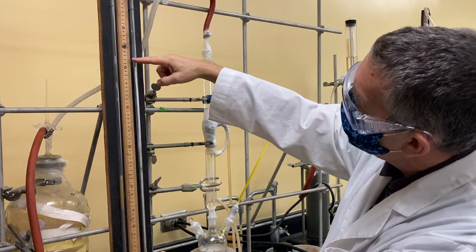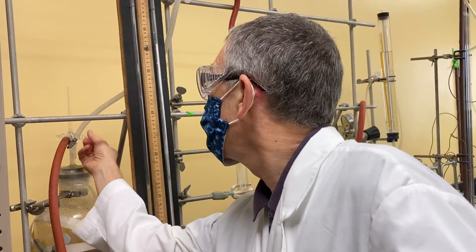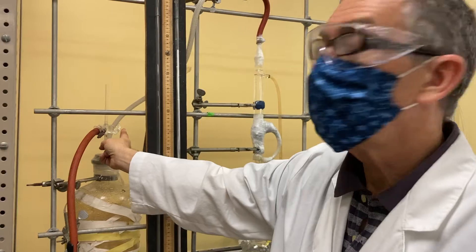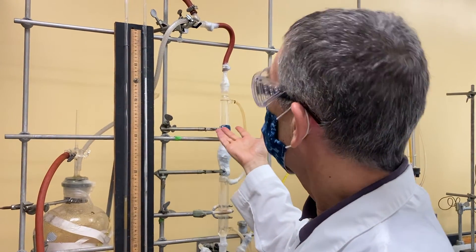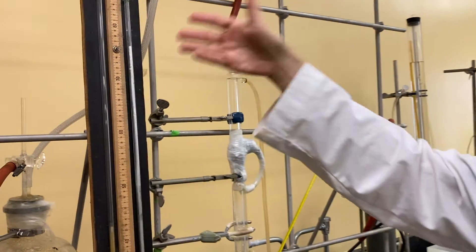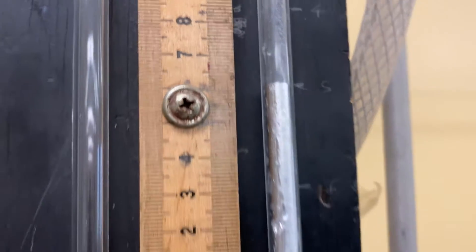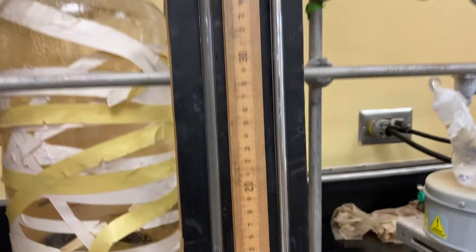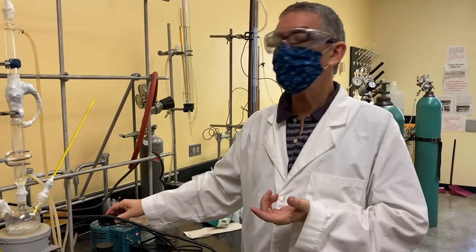What we want to get is a difference of about 73 to 23 — something like that. When I turn this so it's at an angle, I have now taken the vacuum pump out of contact with the system. We have a closed system. At this point you may want to wait a few minutes and see just how stable the pressure is. It will not be perfectly stable, but it should only be a slow drift. When you take your pressure, you record temperature and pressure at the same time. And now we'll turn on the rheostat — a setting around 50 is probably good, it's not critical — and now we're going to wait until it starts to boil.